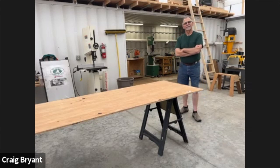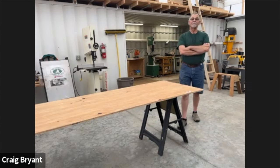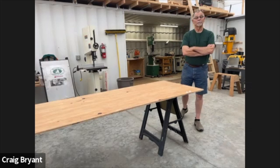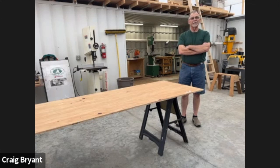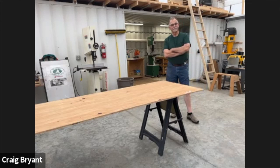Another thing about making straight masts is, if you do a hollow mast and you're using bird's mouth cuts, each one of those staves has a right angle cut in it. So when you assemble the mast from staves that are all not straight, the mast ends up being straight. It straightens itself out because of all those right angle cuts, and the only way it can fit together is to be straight. So you don't have to do very much to get it perfectly straight.